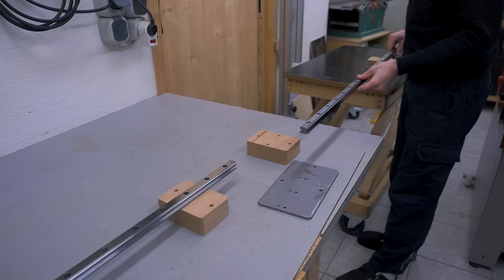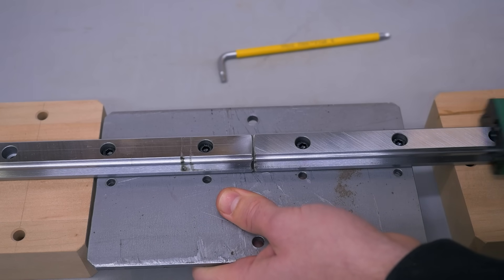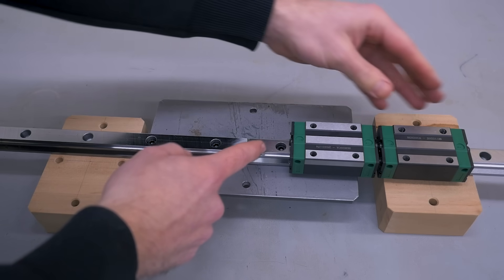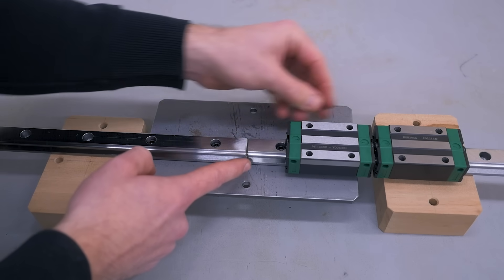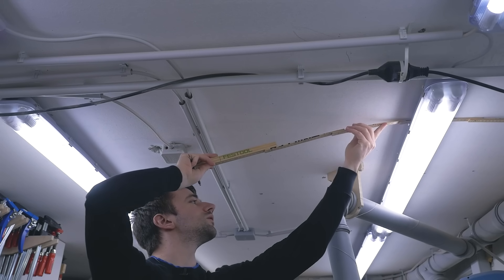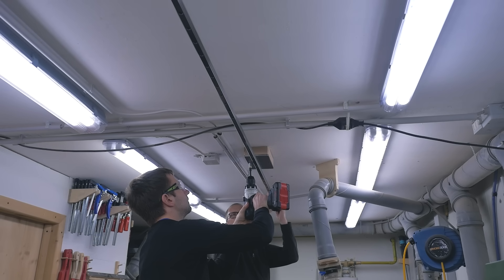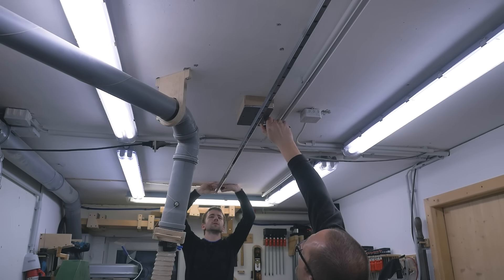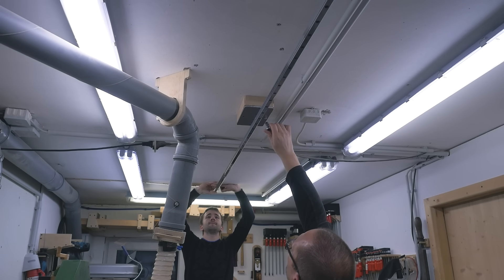With all these parts done, it's time for the first assembly. I start by joining the rails end to end with the big steel plate to make a long one. To align the rails, I use one of the blocks, slide that halfway over both rails and tighten the bolts. Now this is by far not the smoothest of transitions and definitely not the intended way of doing that, but for my camera gantry purpose this should be fine. Now mounting all this to the ceiling — I first measured and marked the ceiling center, drilled one hole for the big steel plate and screwed it up. I did this whole installation together with my dad. Some nice dad and son shop time.